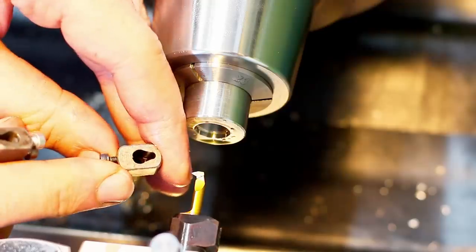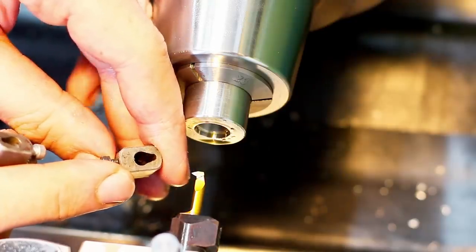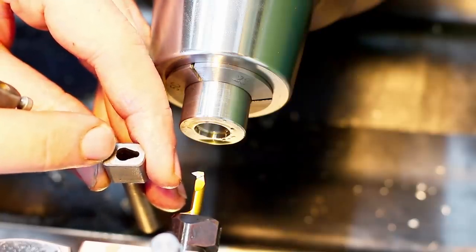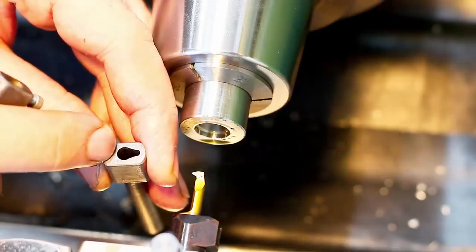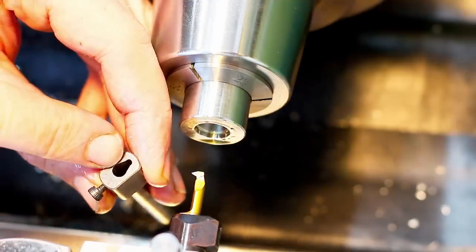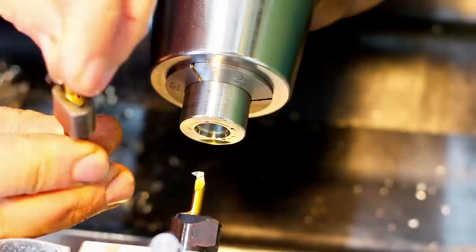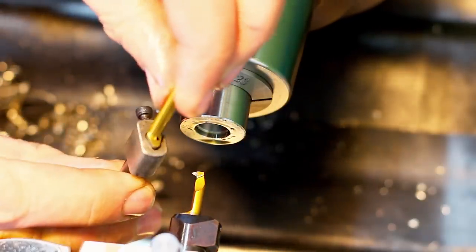I think I did these back when I had my CNC mill, but you can also do them on a manual mill vertically standing up, drill two holes on both sides, then mill the tangents. The ends here, the two radii, don't do anything. The only important surfaces are the two angled surfaces on the outside. That's where the tool seats itself. The radius on the ends is clearance.